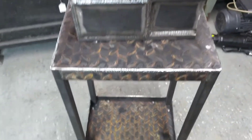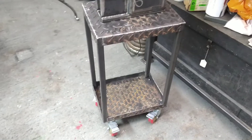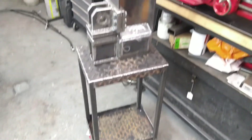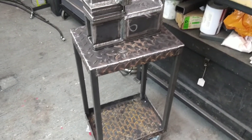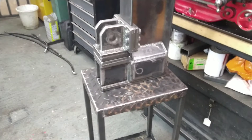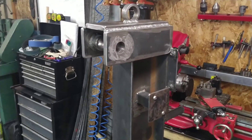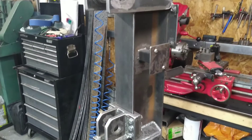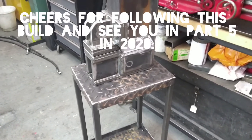And I've obviously welded up the trolley. I may add some more strengtheners to it, but it doesn't seem to need it. It's very rigid and pretty stable as well. The casters are rated to 600 kilos so it shouldn't be a problem. And obviously the tank, which is over here, it's been filled for a few days just to make sure there's no leaks, and so far so good. Obviously going to the oil tank in the bottom, and then a place for all the tooling, which is something I need to make. I think I'll get the whole press finished, working, operating, all piped up, and then I'll think about how I'm going to go about the tooling - what sort of tooling I want to make. So yeah, there you go. It's New Year's Eve 2019. I guess I'll see you on the next video, part five. Right, cheers guys, I'll see you later.